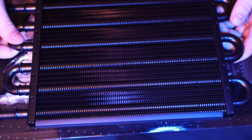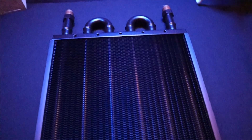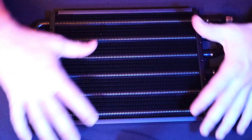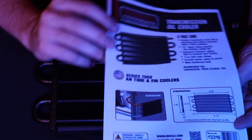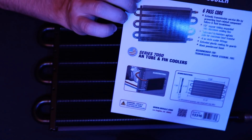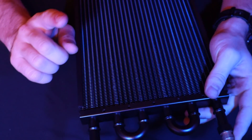This thing is bigger than the radiator on my condenser outside. I wanted to get something with a lot of passes — this has six passes in it — because in between flushes the water is not going to be moving. Of course it will kind of transfer to the water sitting in the rest of the tubing, but I primarily want to get as much water mass in the actual coils at one time as possible. Next up is to try and get fittings that are gonna connect to some clear tubing running between the wall and the toilet out to this. I'll go to Lowe's tomorrow during my lunch break.